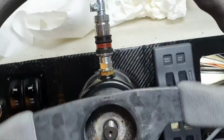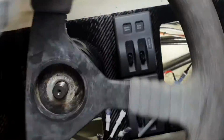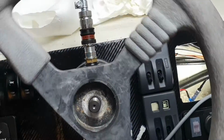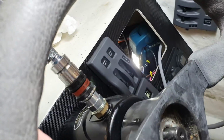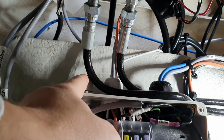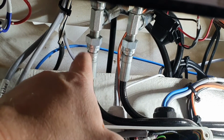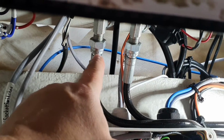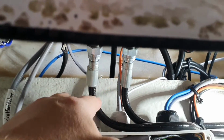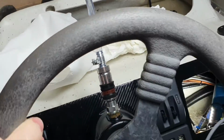So why do I want to buy something? Do I plan to fill it again? Yes, I do. I think I will change my helm pump in the future. Even 5.5 turns is too much for me, because I want to be as quick as possible to get out of the stony place and something like that. And also, I told you in the previous episode, these original plastic pipes are quite bad, so I want to change here to make either a 90-degree angle and keep these pipes, or in the future probably replace them. And this means I will again need to do this procedure that already took about 3 hours, I guess, with all recordings, etc.